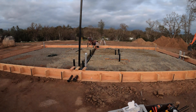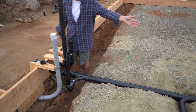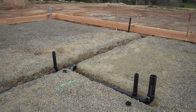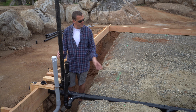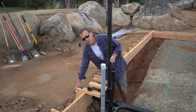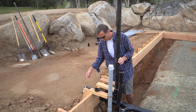Now that it's complete, you can see we've got our main three-inch line that drains all the way across the building with individual stub-outs that tee into it. We'll show you each stub-out, but for now that's the main building drain going through. It stubs out on this side of the footing so we can attach a clean-out here in the future if something gets plugged up.